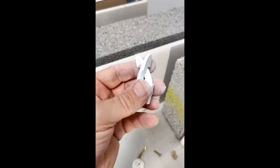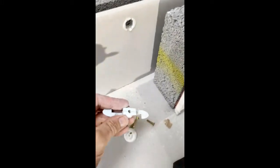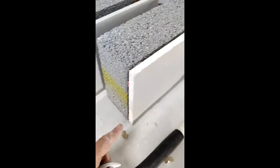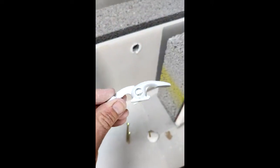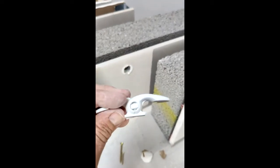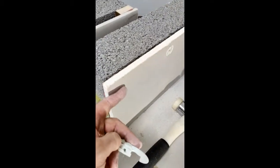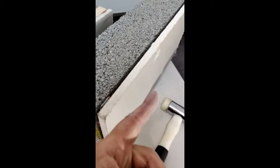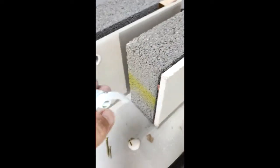The beauty about Bullfix fixings is that once these have opened, not only do we supply screws with these — including a bespoke shorter screw for the 7mm cavity — but these will actually take a standard number 10 screw or 5mm diameter screw, meaning that most joiners and builders will have a selection of different size screws. If they want to attach something larger, like timber, it would be your timber width plus the plasterboard plus the cavity that you'd be allowed to travel.